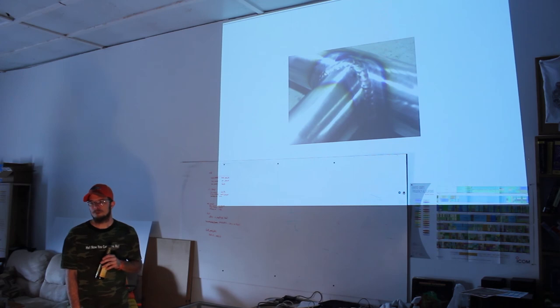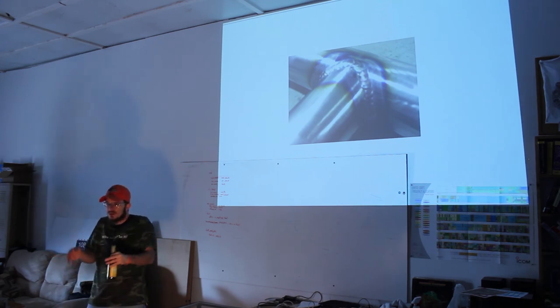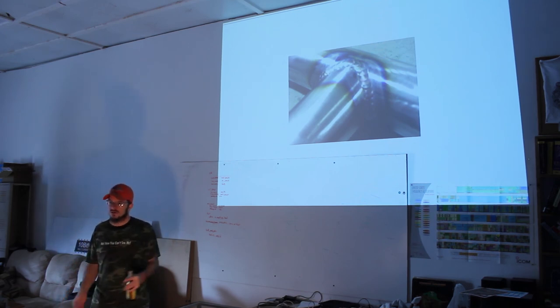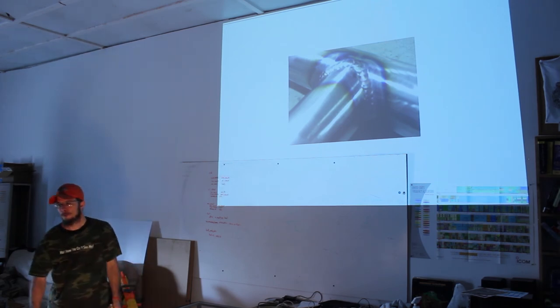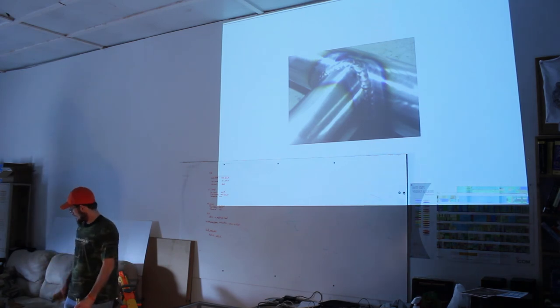And then it just expands. It's trapped inside of concrete. Yeah. And when it gets trapped, when it vaporizes, it expands its volume exponentially, instantaneously, right? And it just blows out fissures. Huh. You say fire rocks. Are these kind of like little bricks you got? Fire bricks. Yeah. So it's fire clay.